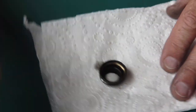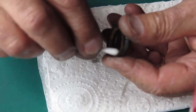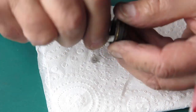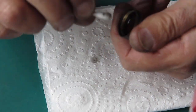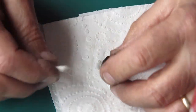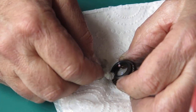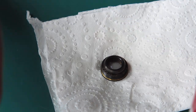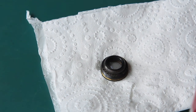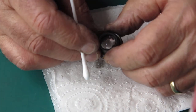If you look through from the back of the camera as you release the shutter, you should see that the diaphragm is shut right down, closed right down to its smallest setting. You can judge that fairly well. There's no percentage in winding up the spring tension beyond that point, because you'll just end up damaging the spring. You just can't get an infinite amount of tension out of it — if you over-stress it, it won't be good.